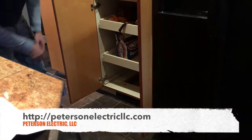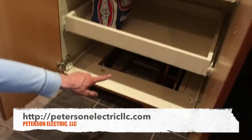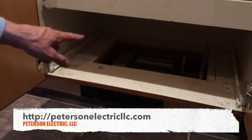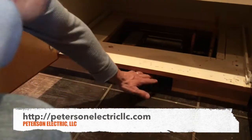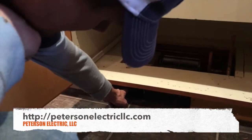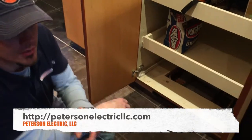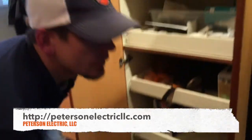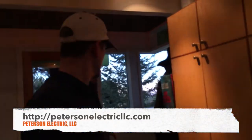And then this one right here is kind of the same effect. This is the one I think that blew. Well, you can see they cut off the conduits there years ago. We just made sure that the fan was running on this one, because we're going to try to see if that hot air will just pull and suck this way, and they just have an on-off switch right here. If it doesn't, we'll have to come out of the panel with another circuit to hit up here, dedicating it as well. He wanted to just try one for now because he's got a heater over here.